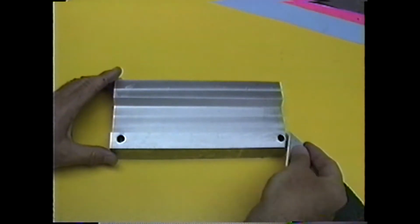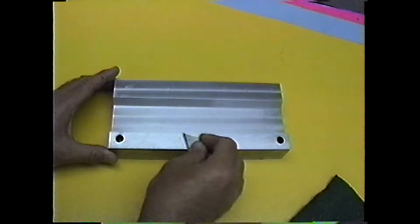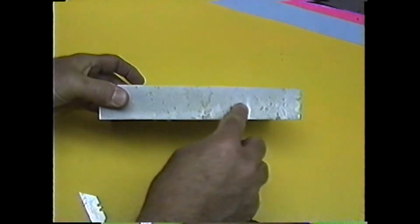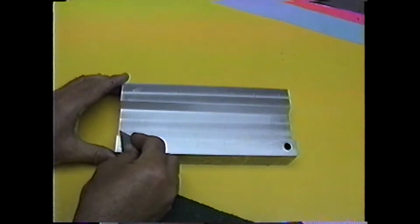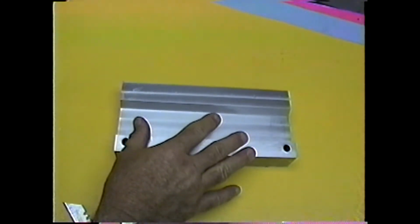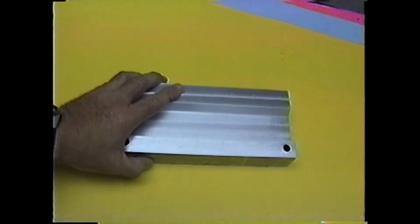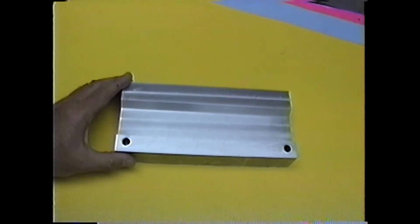Again, it's preparing and cleaning this up that results in having that really nice finish on a part too. So it allows the mold to close perfectly then instead of almost perfectly. And about every 5 times I'll clean all this off the side of the mold. But the point is too, once you have a good quality tool, forever and ever, you can make parts. Once you have a mold for any part and it's polished and you're getting parts releasing, it's the last time you ever have to make that part other than just mold up another one.